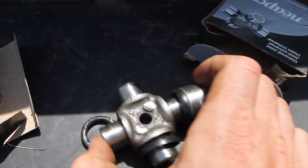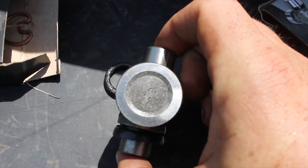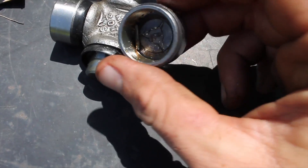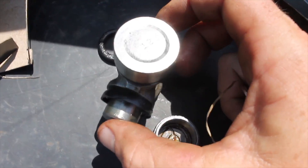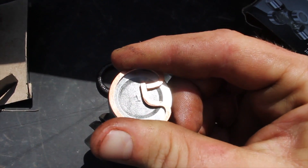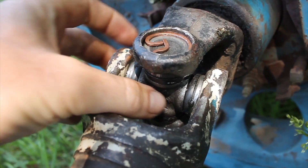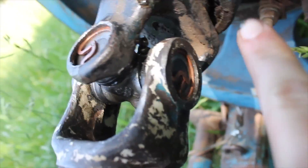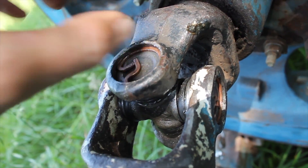Pressing this piece down through the yoke to get over the universal joint is the toughest part of it, and then you've got to kind of pound this in to the yoke without knocking out your pins. This clip, once it's inside the yoke, will then squeeze down and hold everything in place inside of the yoke. This is another shot of our universal joint. We've got our universal right here in the center, the bearings that are pressed in, and then these pins clamp down on top and kind of slide into a little notch of the yoke.